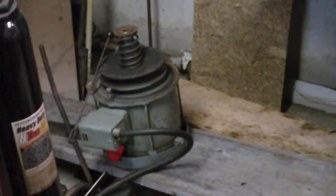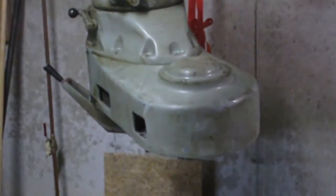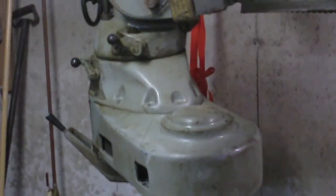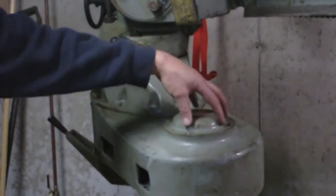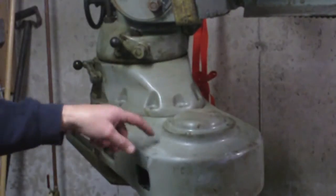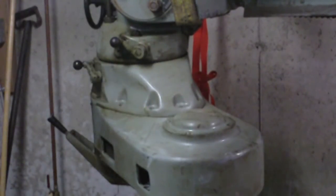So the plan is going to be: I'll install the motor on the head with the head upside down like this. I'm also going to clean it while I've got it in this position because it's going to be a lot easier to clean the whole underside when it's facing up. I was looking at this and realizing that if I take this little access plate off right here and raise the motor up from underneath, it should be pretty easy to get the belt and everything back on.